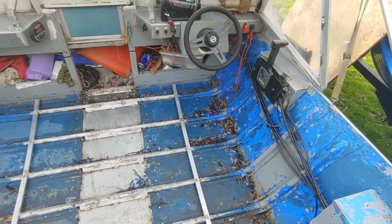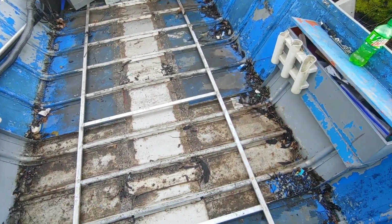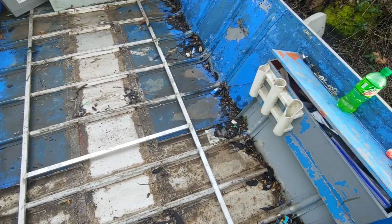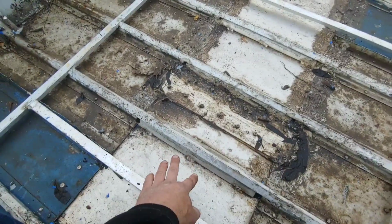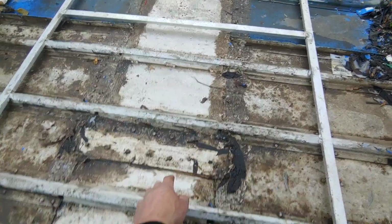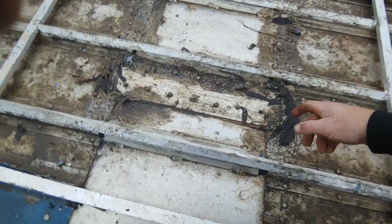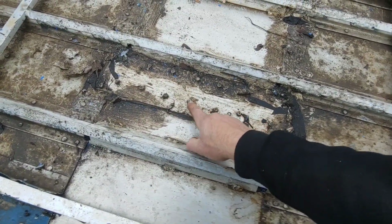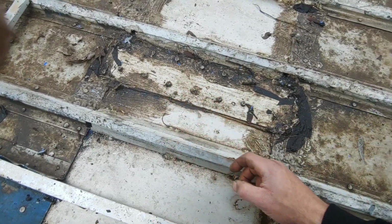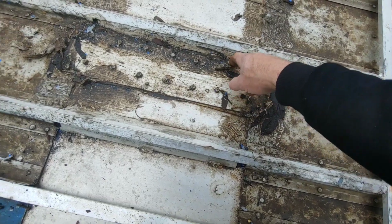Okay, all the carpet and plywood has been removed, and we can take a good look, see how this thing's fared in the last 3 years. You can see this right here is where the front sheet of aluminum and the rear sheet of aluminum meet, and this is a really thick, I think it's 3/16 by 4-inch flat bar that I used some colossal smash rivets, you know, aircraft rivets through here. And of course the Gorilla Glue construction adhesive.